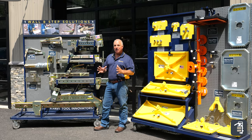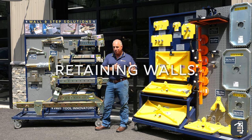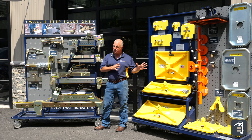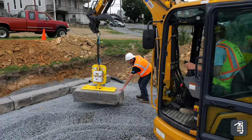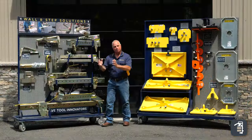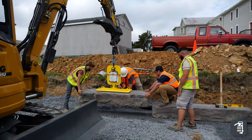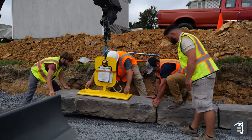The next category is retaining walls. Retaining walls can be rather challenging when it comes to vacuum. Most of the products have a core; some have a channel on top, so it's hard to get a vacuum seal on that product to be able to pick it. However, you do have some simpler products — say Brussels, or the Rosetta products. Some of those large irregular stones — we custom made a pad strictly for that product to be able to get it from pallet to pavement using vacuum equipment, and it is very, very easy. It works great because you have the irregularity of the products and you don't end up marring the surface with the pads.